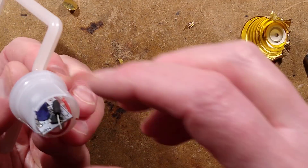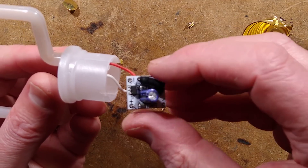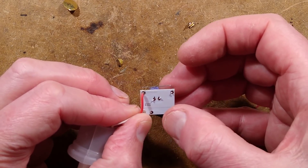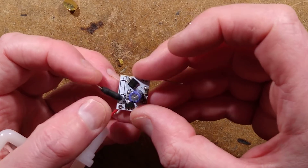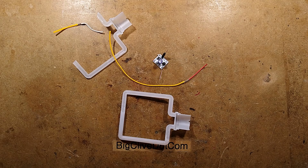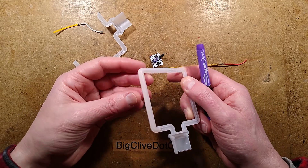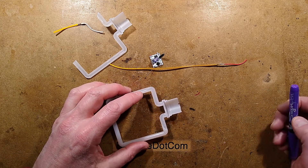It's out. What do I see? I see a little capacitor — there is not a lot in here. I see a little linear current regulator — it must be a linear current regulator. Let me put my finger across it — it's fully discharged. I'll take a picture of this so we may take a closer look together. And resume with that very broken lamp. This thing isn't going back together, but it has sacrificed itself for our greater knowledge. There's still a bit of the filament inside because it really is glued together and doesn't come out very easily.